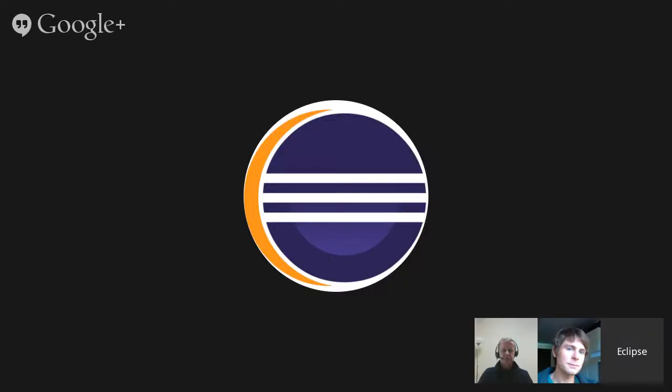The Raspberry Pi is not really low power, right? No, exactly. I think you can run on the battery for like 2 years, right? Yeah, so this is one of the nice things about running it on a microcontroller, where everything's in one chip. And one of the things about JavaScript is that it encourages you to write things in an event-based way. So you say, when the button is pressed, do this. 10 seconds later, do that. And the interpreter then knows exactly what it's waiting for before it has to wake up, whether that's a time period or an input changing state or both or something else.